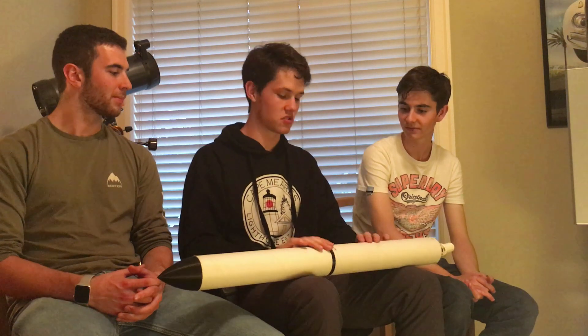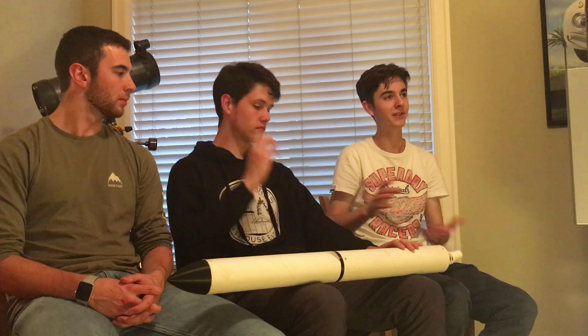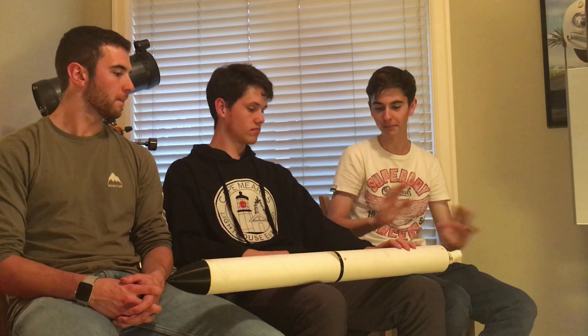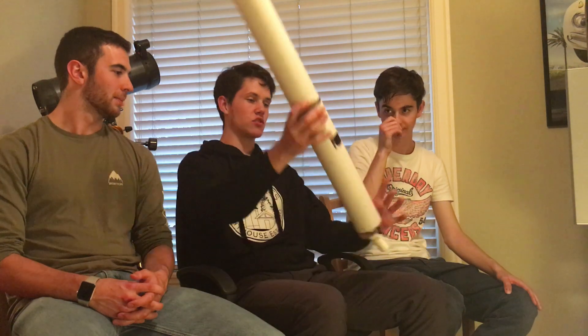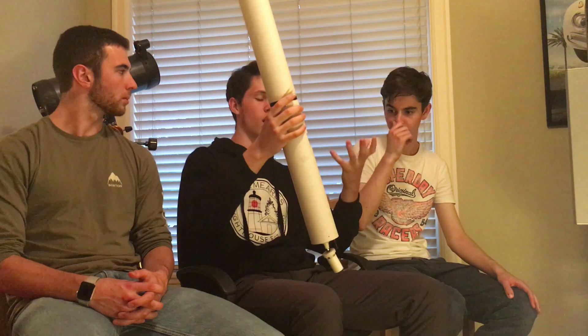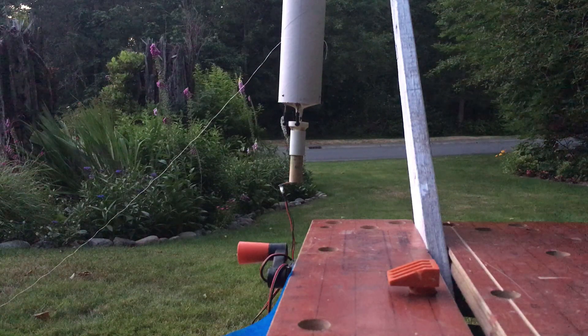The second time was just as good. We were so surprised by how well it worked the first time that we were playing devil's advocate with each other — like, maybe it was too far down, maybe there was too much friction in the gimbal. So we accounted for all of that the second time: we moved it up and put WD-40 on the gimbal to make sure nothing was interfering with our results. It still performed perfectly. So the next idea, just to make sure this thing was really rock solid, was to tie a string onto the body of the rocket and pull it while it was firing, to see if it could correct itself — simulating something dynamic in flight like a little bit of wind or a minor instability.